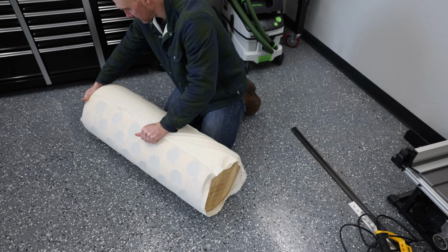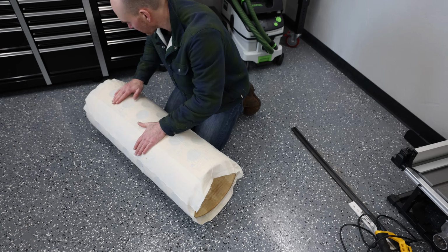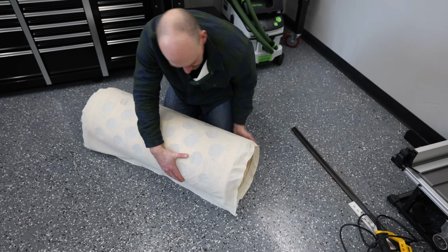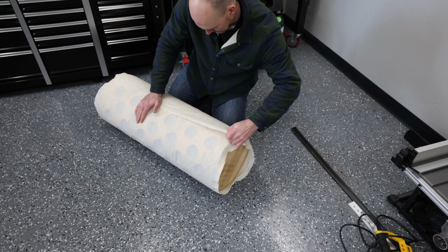And we're going to try to utilize the piece of wood that we have running down the middle, and that's where the seam is going to be. The technique I'm using is simply to pull the fabric over the top and try to get a really good stretch on it. We're going to be pulling it from the top and bottom, as I'll show you later, so you'll see how that goes. Then just staple it on down.